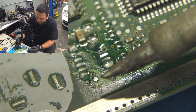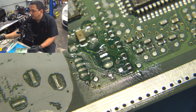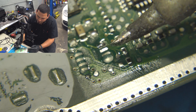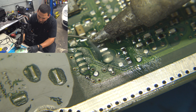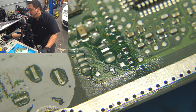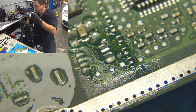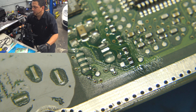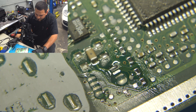This is how you want your tip to look — you want it clean. Once it starts looking black, solder won't jump on easily. As soon as it touches the solder it should flow. If you're not getting that effect, your soldering iron needs to be cleaned. There are tip cleaning products you can use — they're great. You also have these soldering tip sponges, but you don't want to rely on the tip cleaner paste as much as the sponges.